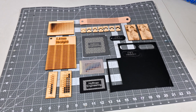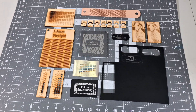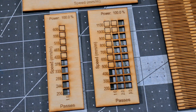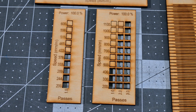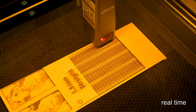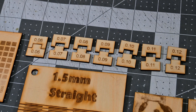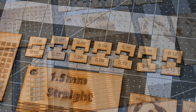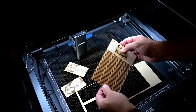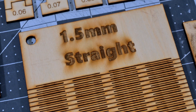Now let's look at how well the Eye Engrave Cover cuts and engraves. The 10W Eye Engrave was cutting 1/8-inch plywood between 300 and 400 millimeters per minute, though not reliably at that upper bound. I think the air assist is holding it back — sometimes I'd get full cuts at 400mm/min, but sometimes I had to drop all the way down to 300 to ensure it cut through. Kerf tests show a 0.06mm kerf offset, indicating a pretty well-focused laser dot — pretty good for a 10W laser. This living hinge cut cleanly at 300mm/min, but you may notice soot marks around the engraved letters due to the air assist not clearing soot adequately.